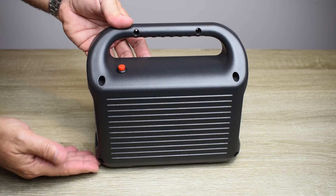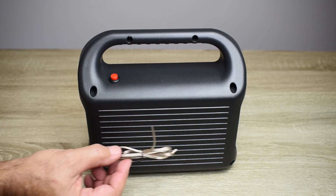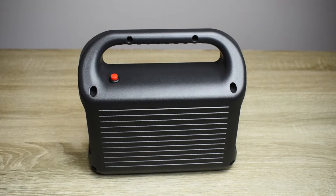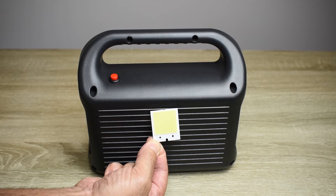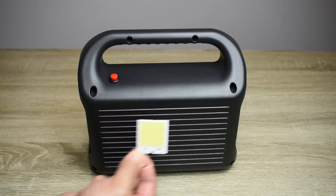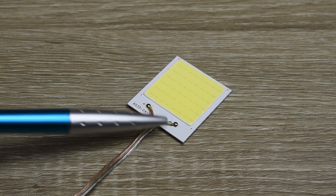You can see how nice that looks installed on the cover. The next thing I need to do is separate the ends of the wire, strip about an eighth of an inch off, and solder it onto the COB LED. The positive is the round circle and the square on the right is the negative. I'm going to position it near the top and secure it with double-stick tape and E6000 adhesive. Once that's bonded it will not come off. And right over here you can see a very nicely soldered connection to that board.